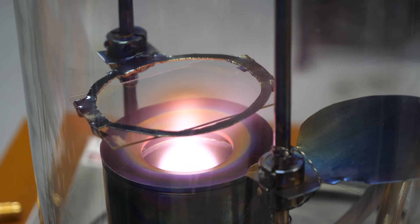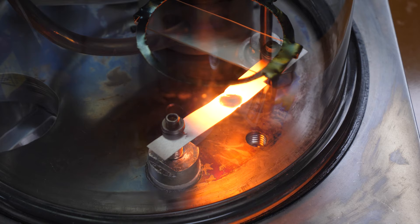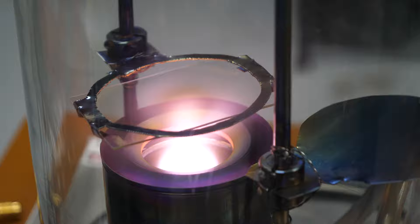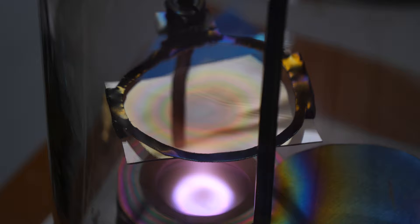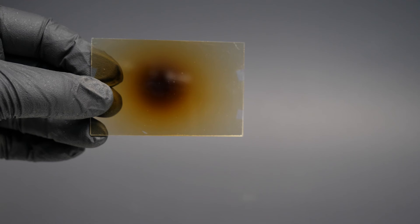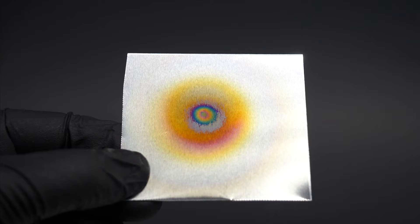Let's wrap this up and look at some pretty sputtering footage. First up was an attempt to thermally evaporate some glow powder — I really want to be able to make thin glowing films, but our attempts failed pretty hard. When we tried to do it thermally, we basically burned the oxygen out of the material and were left with a thin silvery layer that might actually be a strontium-aluminum alloy, which was pretty weird. We also tried laying the powder on the magnetron head, but that failed spectacularly. The experiment I think you'll be most excited about involves a little bit of propane mixed into the argon with a piece of graphite foil on the sputter head — in theory, we're actually growing a material called diamond-like carbon. I'm having the samples tested to see how diamond-like they really are, and I'll save the results for the next video.